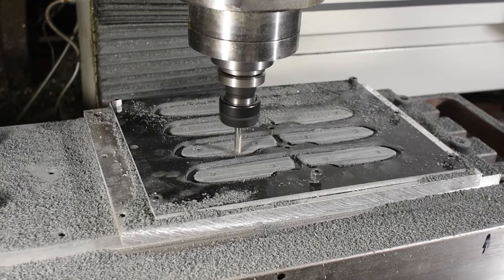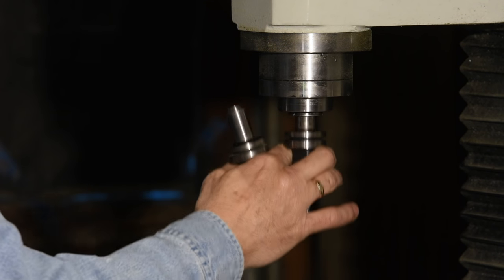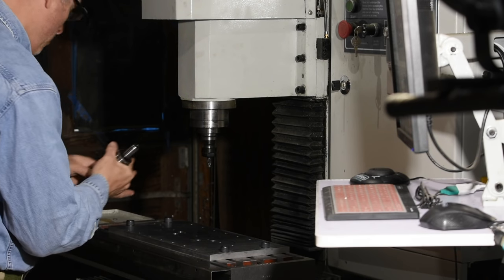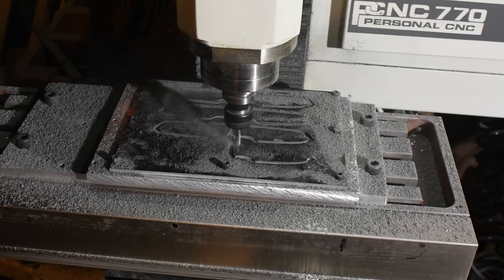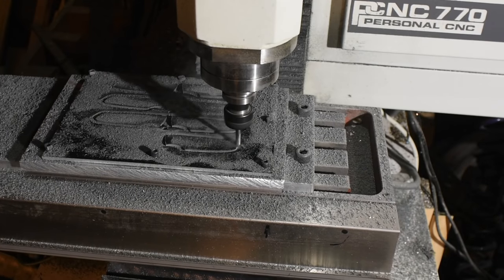Things that will lubricate the machine, things that will lubricate and cool the parts that you're milling. You can also control the tool holders by adding a pneumatic gizmo which helps you change tools relatively quickly without tightening and untightening the draw bar which holds the tools in the spindle. You can even add one — which I don't have — that will change the tools automatically for you.